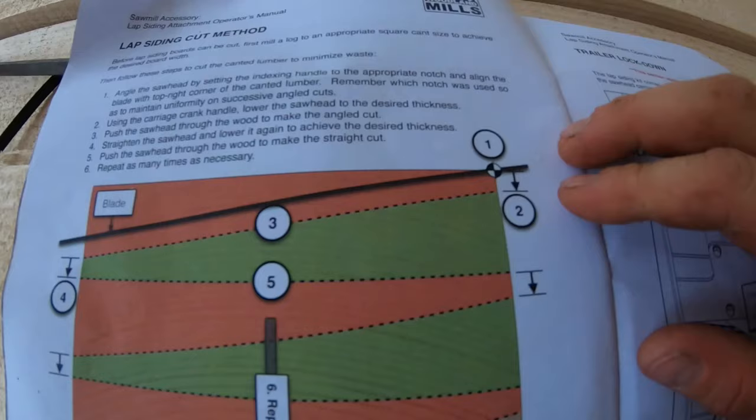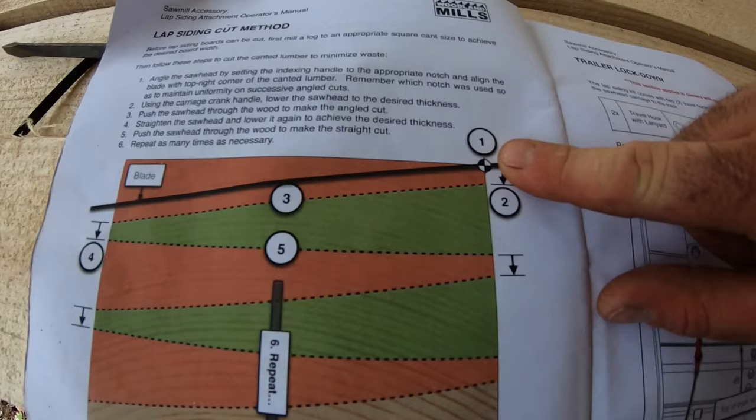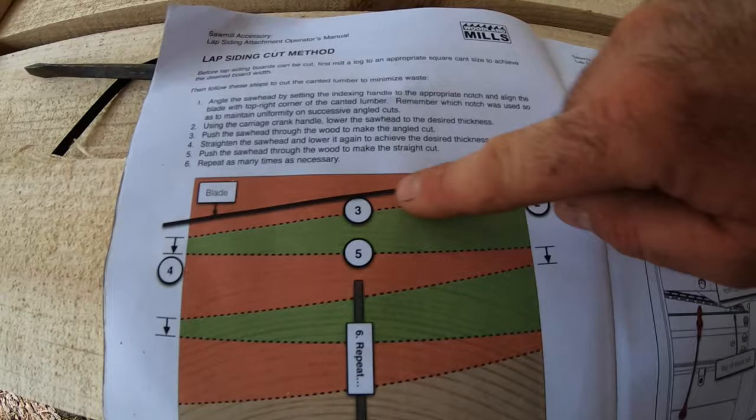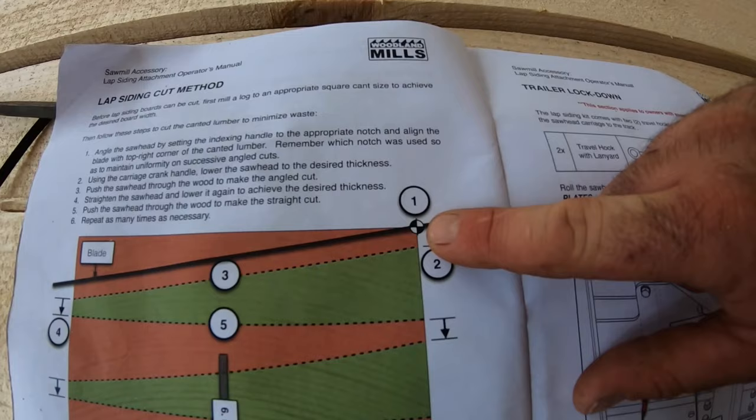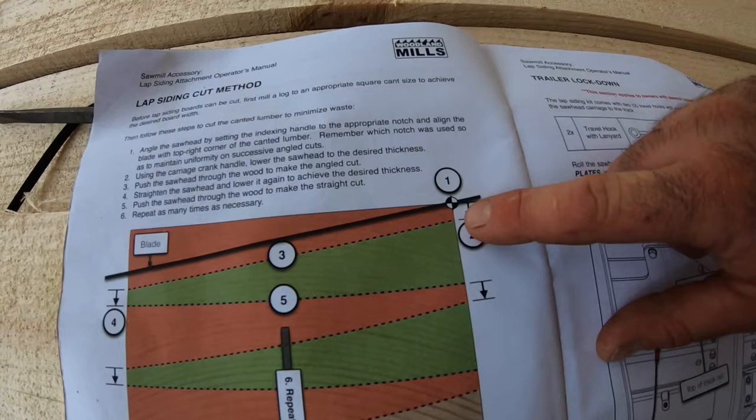To summarize, the very first thing I did was select the notch for my indexing handle. I selected notch number 4. Next, I adjusted the height of the blade, shown here in black, so that it aligned with the top right corner of my lumber cant. Once it was aligned perfectly, I then selected 1/2 inch, and this can be adjusted for your thickness requirements. I selected 1/2 inch and lowered my blade in order to give me the profile of my very first piece